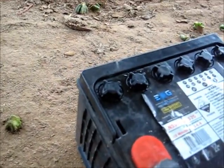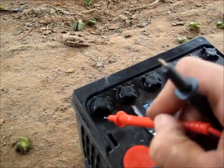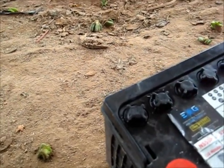That's why this battery is only holding 10.89 volts. Each cell should contribute about 2 volts to make up 12 volts total, but this bad cell has only got barely a volt in it — about 0.89 volts.